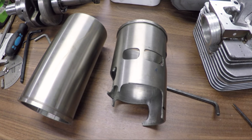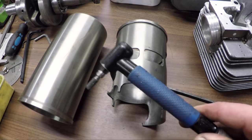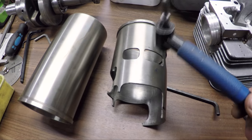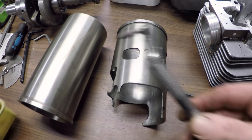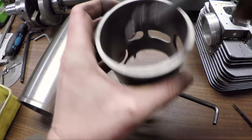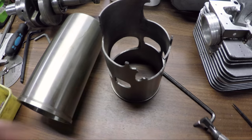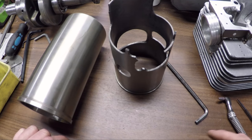I will show you what I am using. For the rough boring with the sleeve in the cylinder I use this Chinese angled tool — it's not great but it works pretty good. And then for finishing up I use this little dentist tool. As you can see it's pretty small, but it's handy because I can get it everywhere; no problem getting at all the angles. I have some more tools for it too, but because it's so small it takes a very long time to do the sleeve.